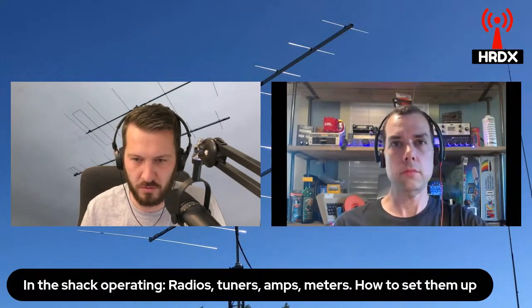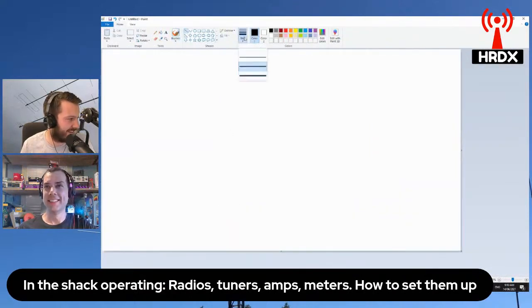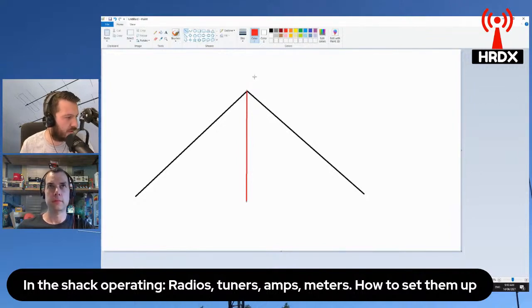I have used a manual tuner before. Before we go on to that, let's talk about that inverted V - I'm going to do some very quick drawing. So what T.O. is talking about with an inverted V is something that looks like this. This is your dipole antenna, and these are the two wires or the two legs of your dipole. You've got this suspended on a pole or in a tree or on a tree limb - some sort of support right there. That's the center feed point, that's where your coax connects, and then each side of the coax is your dipole legs.